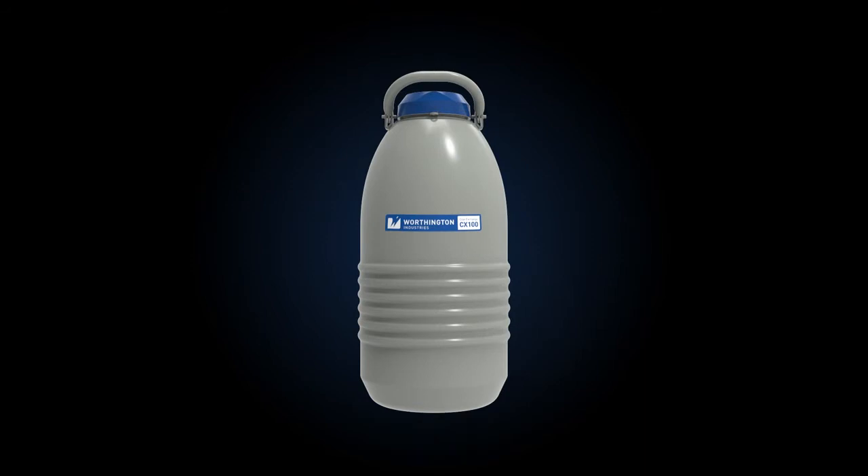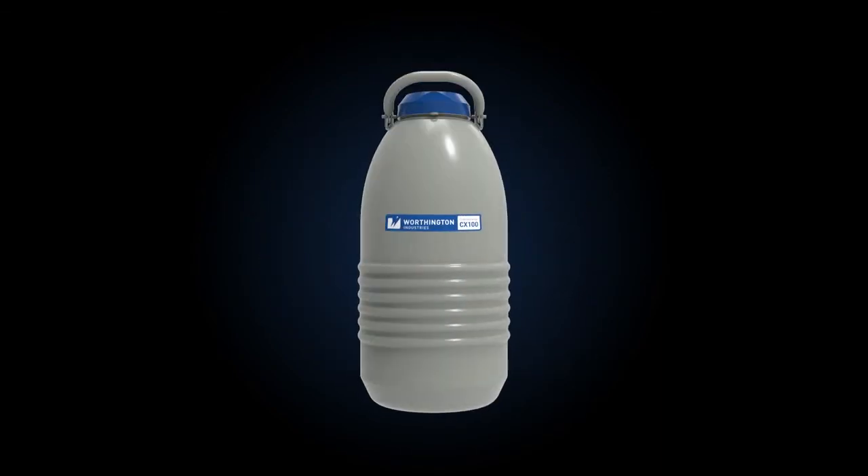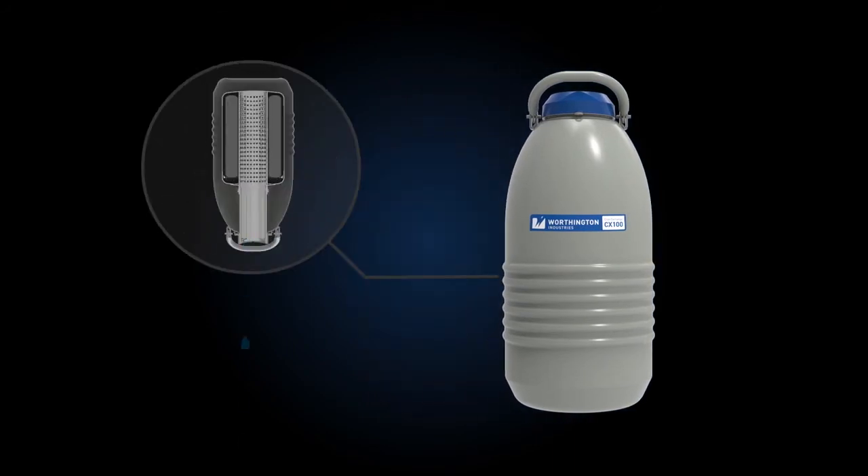After this point, the quantity of liquid standing in the central cavity must be quickly poured out to prevent spillage during shipment. Do not invert the container and allow liquid nitrogen to drip out, as this will result in excess liquid being removed from the shipper and will shorten holding time.